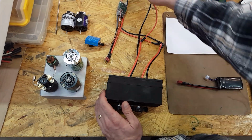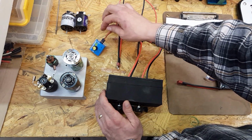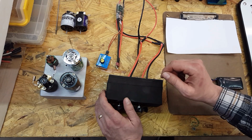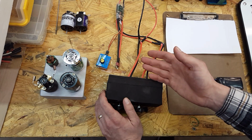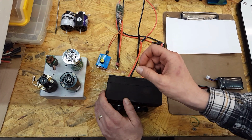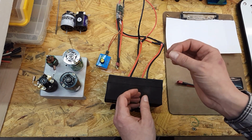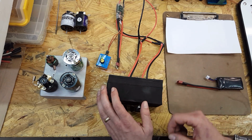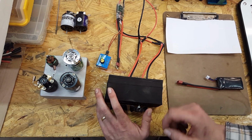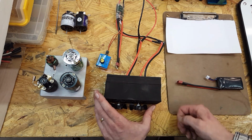What I have here is two Torque Master BR Minis, and for the sake of today's demonstration, I'm just using a little servo tester instead of a radio so that I can set it and forget it. But if you need to set low amounts of throttle for the same purposes, you can actually tape your throttle back a little bit on the rig, or if you have a pretty wide adjustment on your neutral trim setting, plug in your rig, let it arm, and then you can adjust the little potentiometer on your radio to give yourself a little bit of forward or reverse bias. Usually you want a little bit more throttle than the potentiometer can give, so just tape your throttle back a little bit and it'll give you some throttle there for your motors to do tests on.